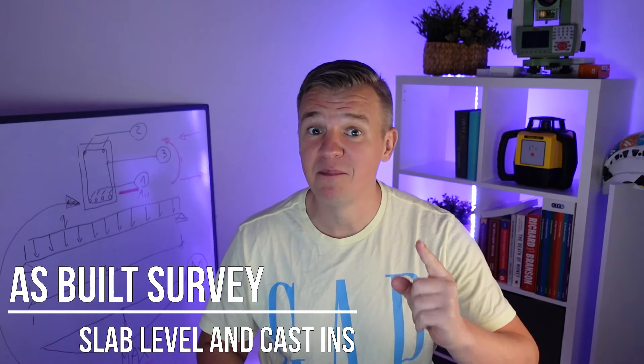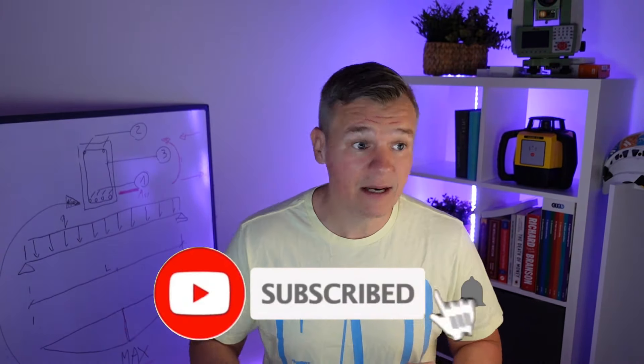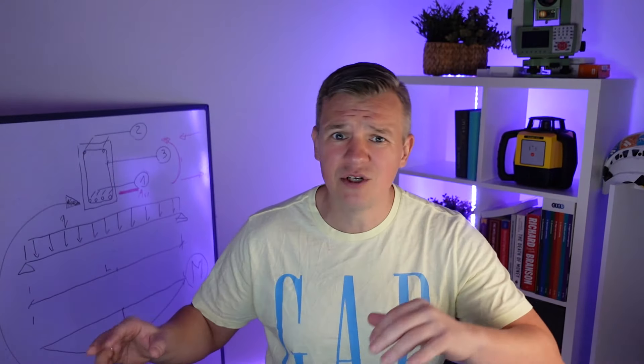As-builts — I know no one is thinking about them but they're very important. For this we want to be first on the slab, and if possible, try to come even half an hour early. If you can start earlier than anyone else, please do it. They're gonna save you time later and take pressure off you. Once everyone jumps on top it's later gonna be too late — marking all the columns is gonna be a couple of times more difficult than when you have the slab to yourself.